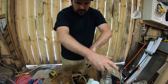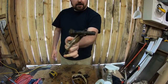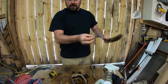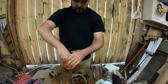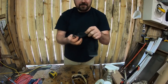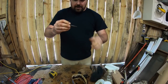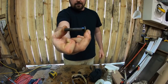Let's see what else we got in here — there was a bolt in there. With the bolt I do the exact same thing; you don't even need a wire brush, I'm just using it to knock some of the bigger particles off. I'm not really scrubbing, just using it like a soft bristle brush. Then I dip it in water and wipe it off. You guys can see — I did nothing to this bolt besides put it in vinegar and let it sit for four days, and that's pretty slick compared to what it used to look like — it was solid rust.